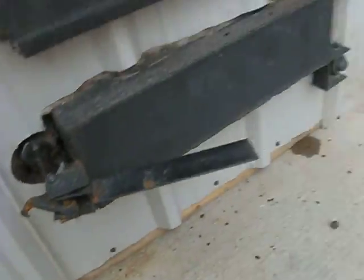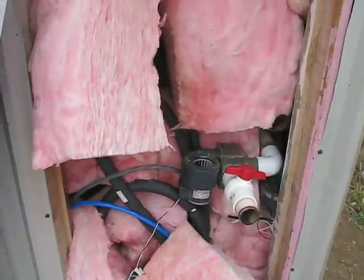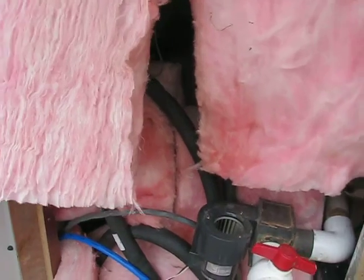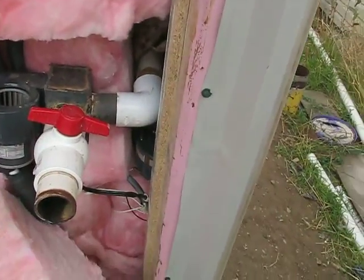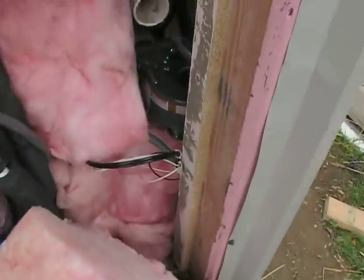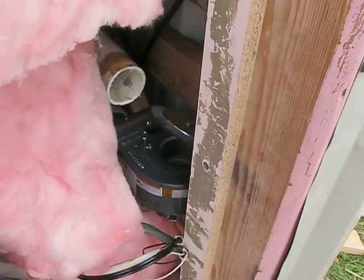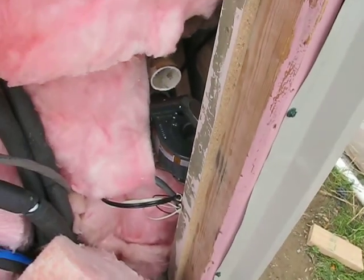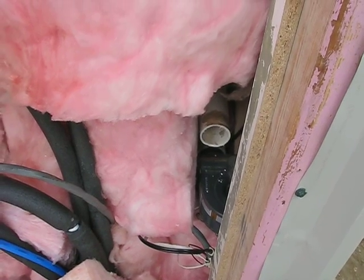So that's working good. You can't really see it all but I got it all insulated. I had to pull this out because I had to turn my valves on. I've got my water hooked up. That's my thermostat for my controller — basically turns this fan. That's my fan. I got a solenoid on there. It basically opens that up, turns the fan on, and when the water is cooling off, once it hits the set temperature, it shuts all that down.